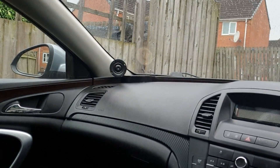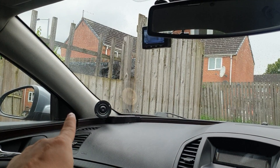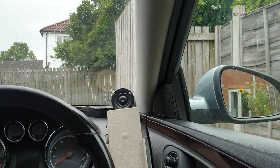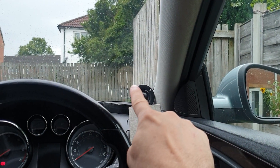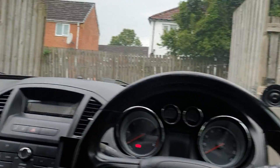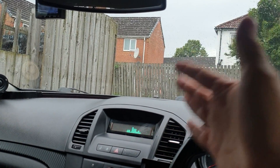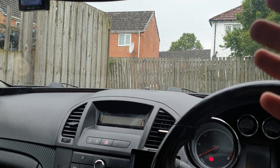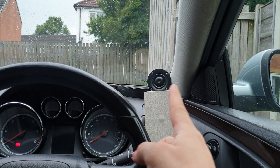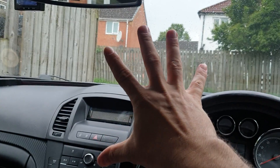My theory is that when these tweeters fire they have reflections coming off the glass. So if you have one source there, you get a reflection from the glass, and when you sum them it sounds like it's coming from somewhere else. With this one you have the main sound coming towards you, there's a reflection from the glass, and it kind of sums — it looks like it's coming from the middle. Those reflections make the center bigger and much more diffused, and the stage is not as wide.